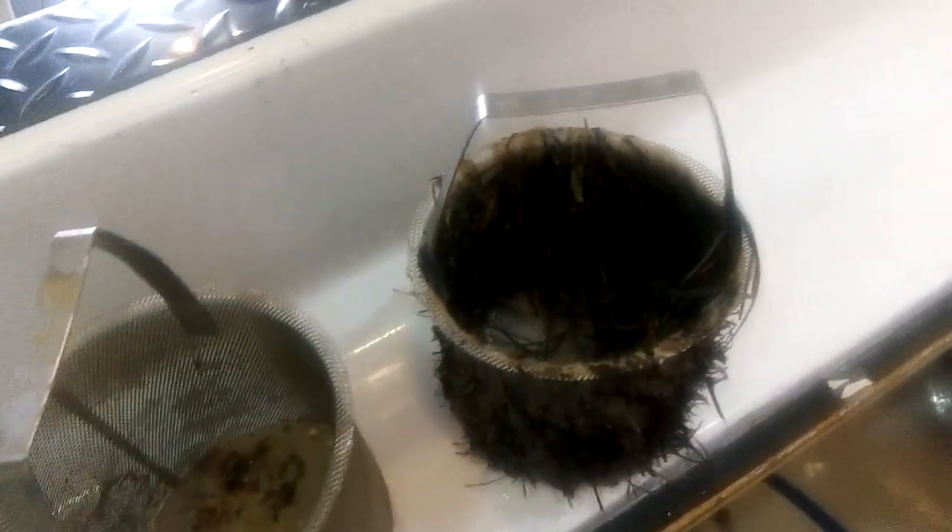The seagrass particles can also develop inside the AC piping, or block the AC. For example, if you have a tube-in-tube AC system, the tube has a very small diameter, and this seagrass can cause problems like high pressure or blockages. That's why you have to be very careful and must clean and check this kind of sea strainer every time.